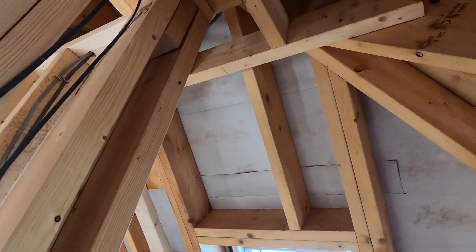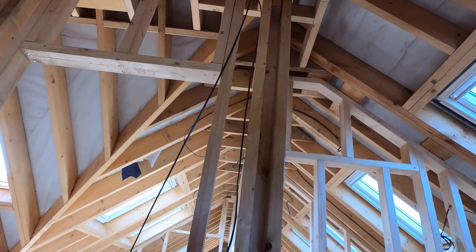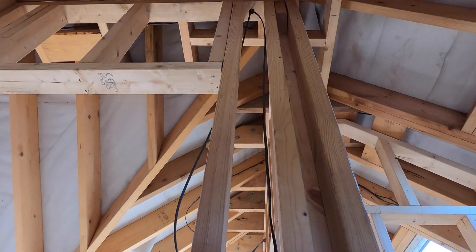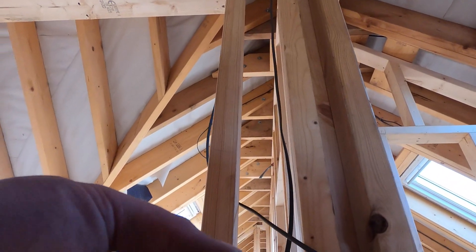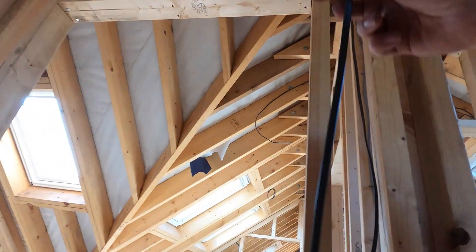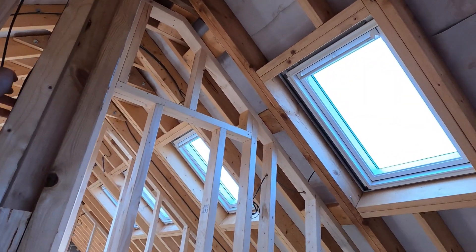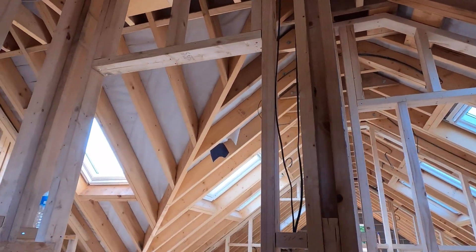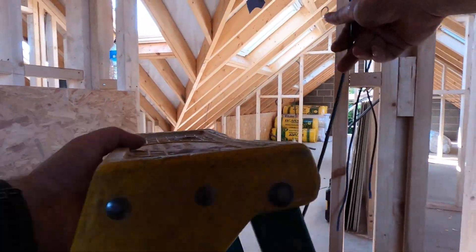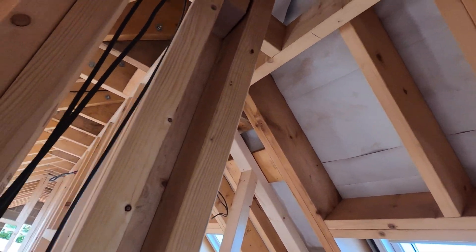Like I said, I did catch one of these cables earlier on with this stapler, so it's taken me a little bit of time to get used to it, but it's definitely faster - that's for sure. On the switch wires, I always just put a little nick on it on these outgoing supplies so I know that's an outgoing leg. But when it comes to these ones over here I always do a little bit more notes as such. So that's the two downlights done.